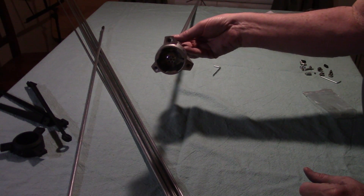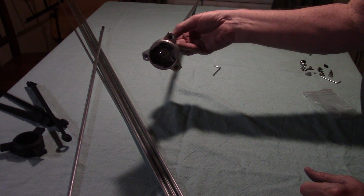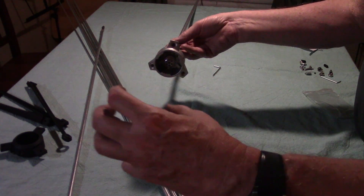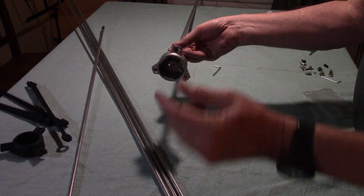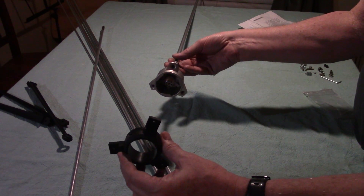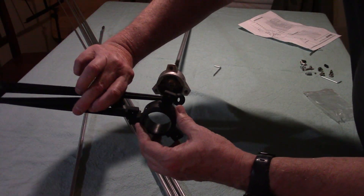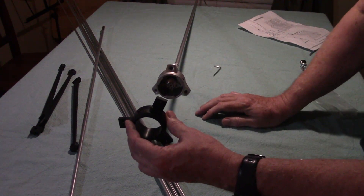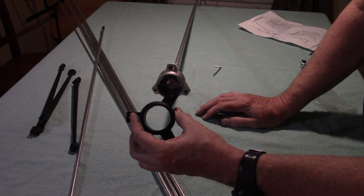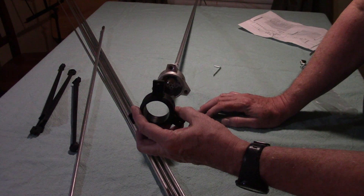This is also why you're going to need a separate piece of mast pole — your coax cable goes into the base, so you can't run your coax down the inside of a single mast pole. You could cut a hole in the mast pole but that would weaken its strength. Instead, you have a shorter piece of mast pole that slides into the base, and your coax cable goes up through it and then down the side of your main mast pole. That's where the plastic sleeve comes in with the three arms that hold your radials, the ground planes, in place.